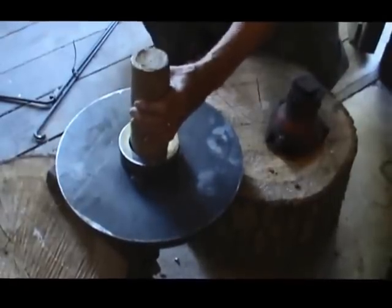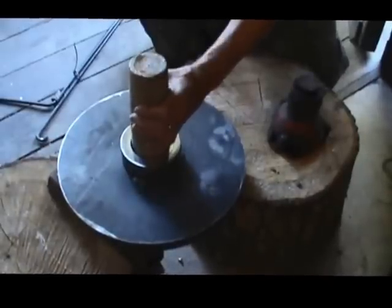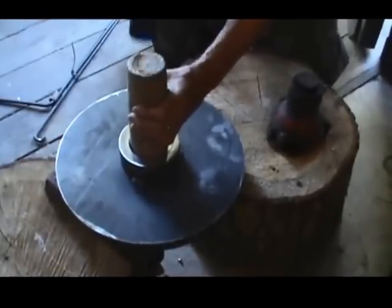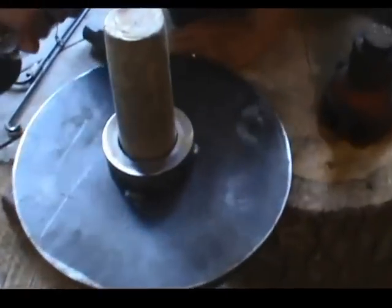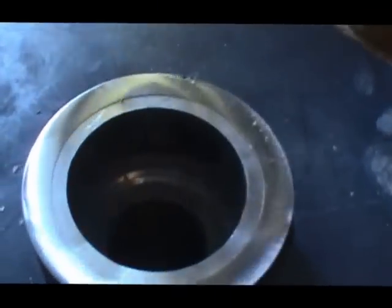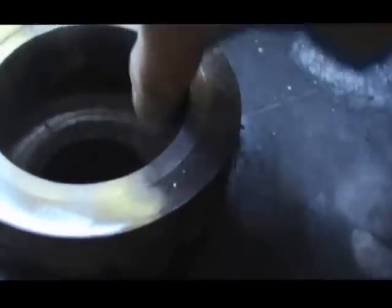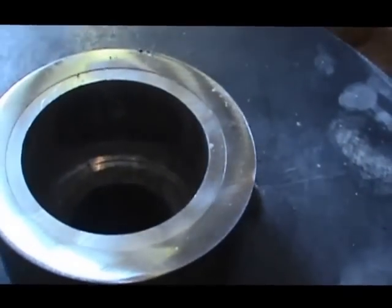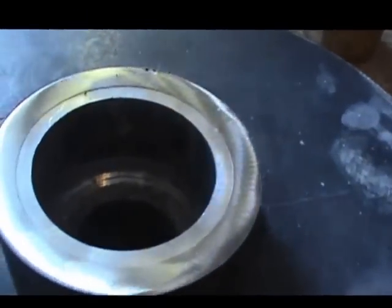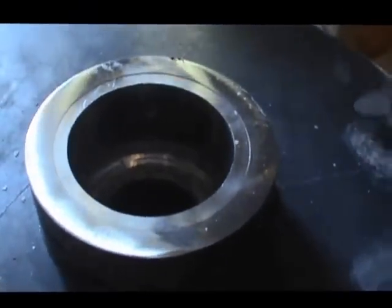That has a taper on that shaft, but it still comes out quite hard. And we're leaving the babbitt behind. Take that out, Brian, so I can show these guys. There you go. As you can see, that shaft is coming out. It's leaving us a good, nice, smooth finish. Almost a machine finish on that. All right, we're going to finish driving this out. We'll give you a look at what it looks like when it's all said and done.